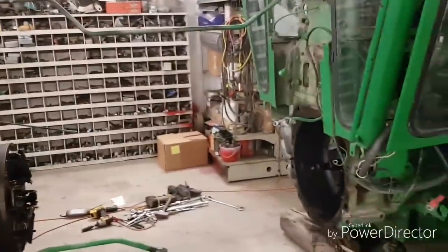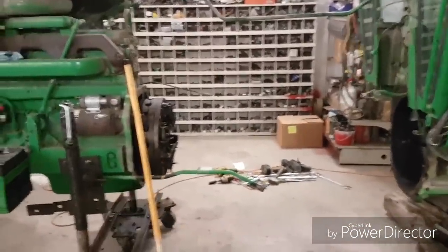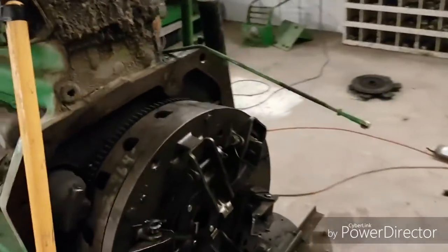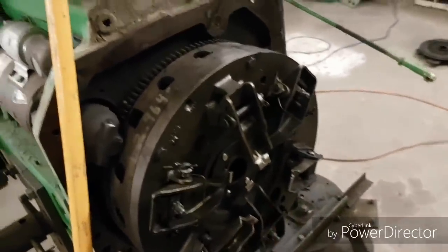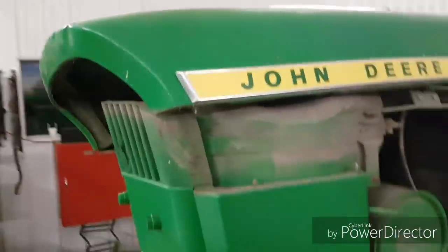He asked Dad, and Dad said we can do it for a lot less than what they quoted him. With parts and everything and our time, it's going to be like a couple grand when all is said and done, to get a new main clutch and PTO clutch done. The previous owner, whoever put the clutch in the last time, like Dad was saying, had one finger doing the work of 3 of them. So nothing was even close to being set right. I got a drippy nose. Sorry about that.